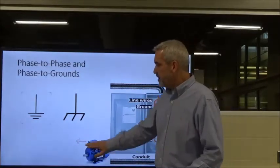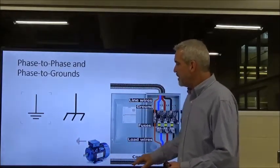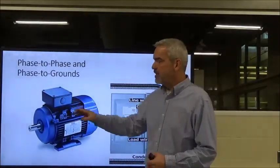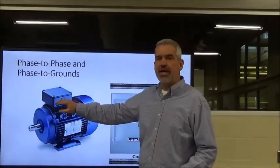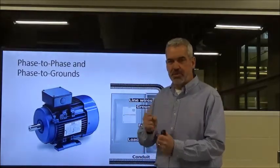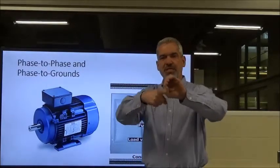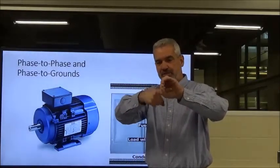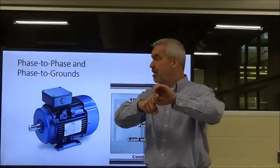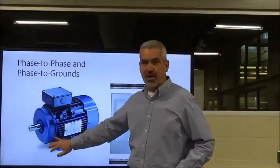Okay, we take our ground to earth ground and put our motor on there. I've seen this happen the most right inside this junction box on the motor, where a lot of times if the motor is vibrating, seal tight or the conduit itself will break as a result of it just being worked and worked and worked, finally it'll break. Well, what you have then is conductors resting on the edge of a metal knockout hole, okay? And that vibration will eventually abrade the insulation, and you've got bare copper coming in contact now with this metal frame. Now, the frame should be grounded, okay?